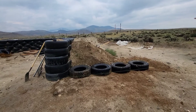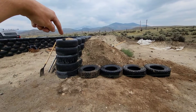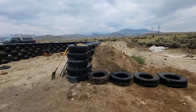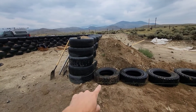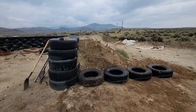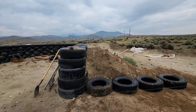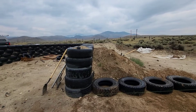I had a few ideas, maybe doing a gabion basket or something to retain that berm, but this ended up being the easiest option. In hindsight I probably would have just pounded all these tires together so that these two walls would be interlocked with the stagger of the tires. I'm going to have to do something to connect these two so that this wall doesn't get pushed out by the berm. Once I get up to the fifth course on the wing walls I can start overlapping and staggering the tires to join these walls together.